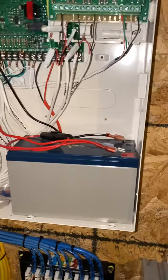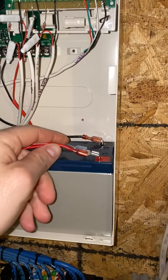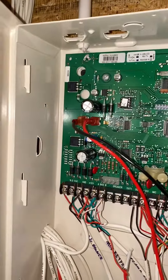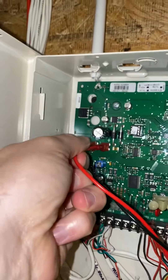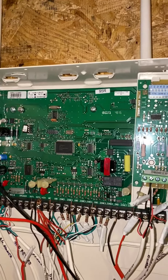The next step is to remove one of the leads from the battery. You see you have a black lead here and a red lead here. The red lead is split because it's going to a cellular communication module as well. You can remove either one of those, or you can also remove the leads from the security panel itself — it's these two leads here. I'll pull the red lead off. You'll have to give it a little bit of a tug, and it popped out. Now all the lights on anything inside have gone off, so I know that the power is gone.